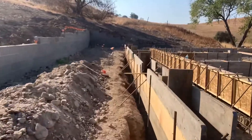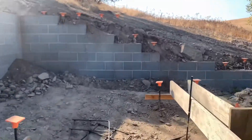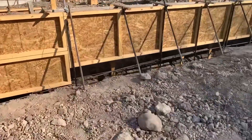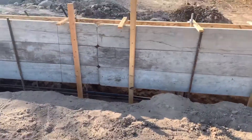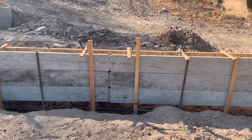The other thing I have to do before pouring the concrete is put a stub for my sewer to go through the footing wall. It doesn't need to be the whole length of the house — just four or five feet to get through the concrete — and then I can tie onto it later during rough plumbing. I'm going to have the four-inch ABS pop through roughly right in there.